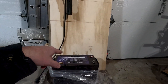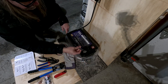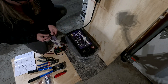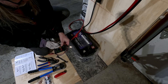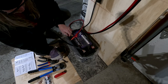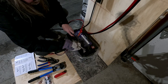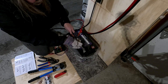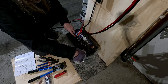I'm going to go ahead and hook the battery back up to it — hook it back up to the battery here. These are 13 millimeter bolts. They say to use gloves with this stuff, especially when we hook this last positive one up. I'm going to hook the negative up first. This is 48 volts at 50 amps, so this battery holds 2,400 watts of power. You definitely want to make sure that you don't cross the two terminals — don't want to short it out; it'd be a pretty big spark. We're working with 48 volts here, this isn't like a 12 volt battery in a car, so a little bit more power. Be careful and don't electrocute yourself.